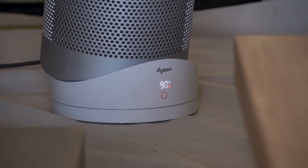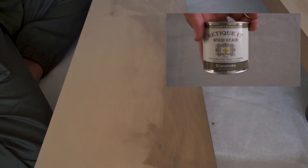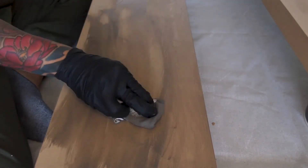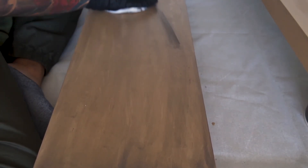Overall I did go with two coats and I did allow a final drying before I applied the wood stain. The final step to this painting project is to stain it using your buffing cloth. You want to move in the same left and right directions — the direction of the grains you created — so it can pick up some of the stain and create natural movement in the graining. Deposit more stain in areas that you want to appear darker in color and buff out areas where you want lesser color.